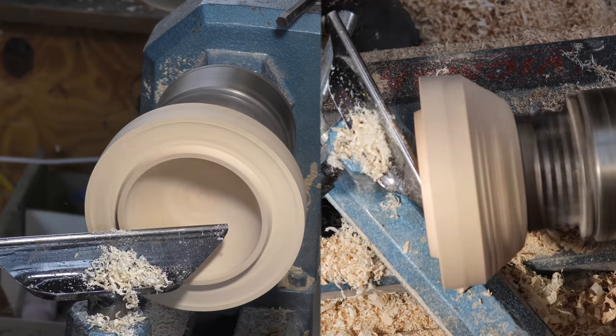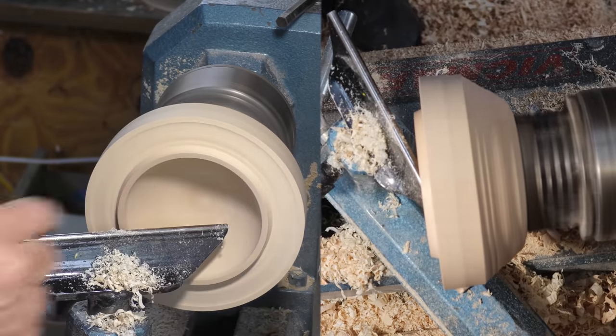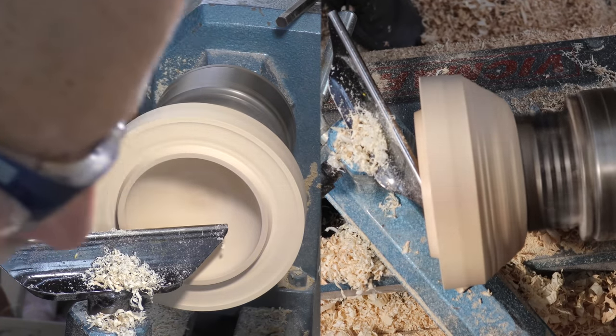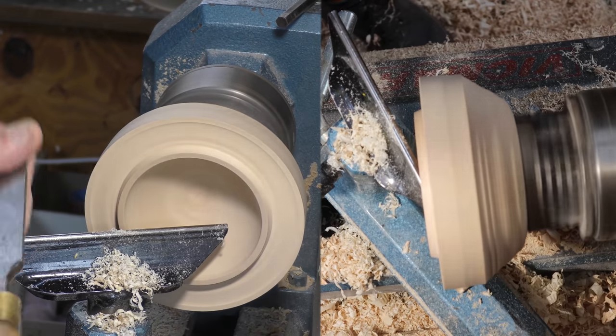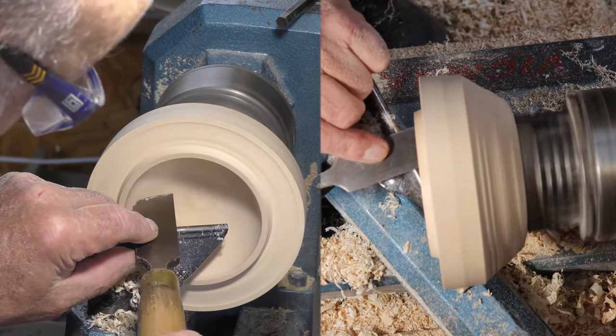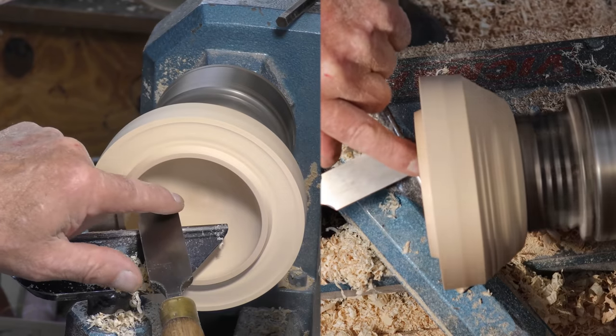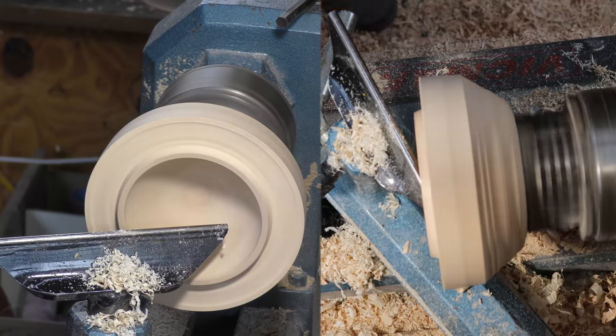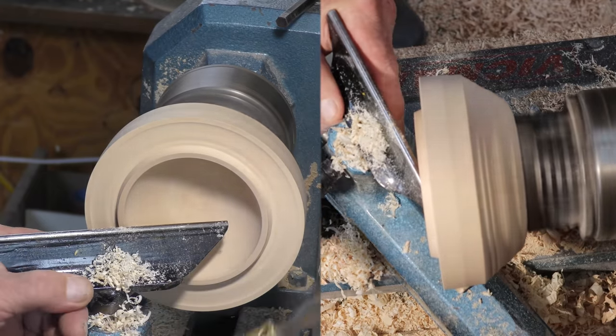So now I need something to expand the chuck jaws into for when I'm shaping the outside. And the best tool for that generally is the little skewed scraper. And can I see it? I have no idea where it's got to. Oh, there it is. Right, so that's going to ease. No, the point's going to get in the way. So we'll just do this with a skew. So this is a half inch skew chisel. I'm going to bring the rest up